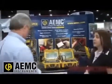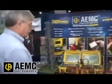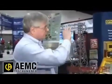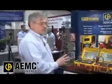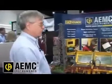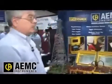Major cost saving for the tower testing because you don't need a 3 or 4 man crew with a bucket truck to go up the tower to disconnect the wire. You'll do the test in about 15 minutes as opposed to about 2 hours doing it the other way. Cuts down on manpower. So your payback for a product like this, if you used it weekly, is about 3 or 4 months; you've paid for the cost of the instrument in savings in labor. Right. Oh, that's very impressive.